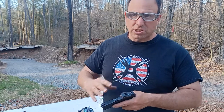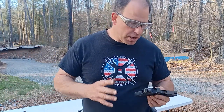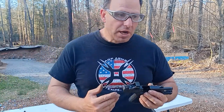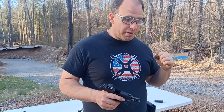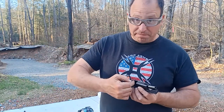The second problem is the firing pins. The ones that come with the parts kits will break within 500 rounds — sometimes within 200 rounds. The ones I've been using are the Aim Surplus billet strikers for the Glock 43, and they've been working pretty good. The problem with the firing pins is they hang forward, and as the case comes up it hits the bottom of the firing pin head, causing a failure to feed. It also stresses the firing pin, causing the head to break off and creating jams.